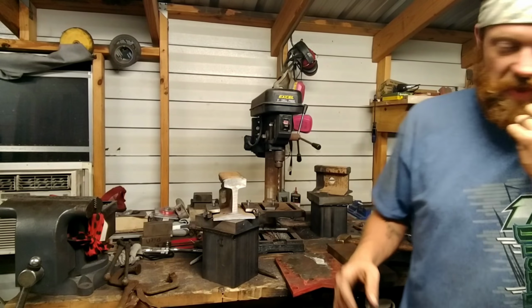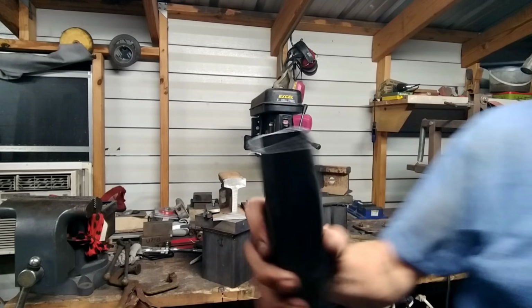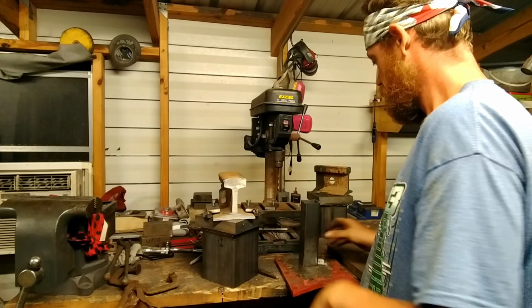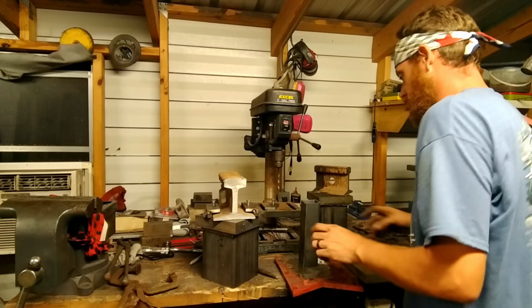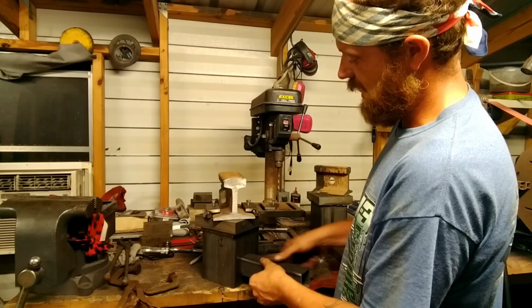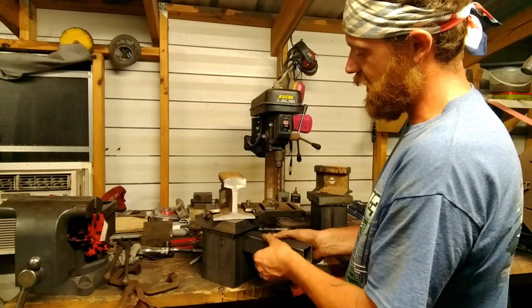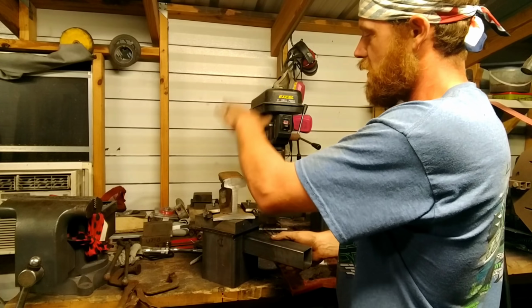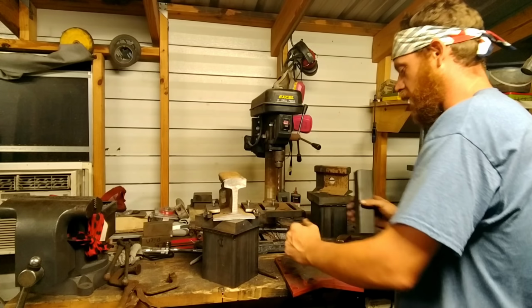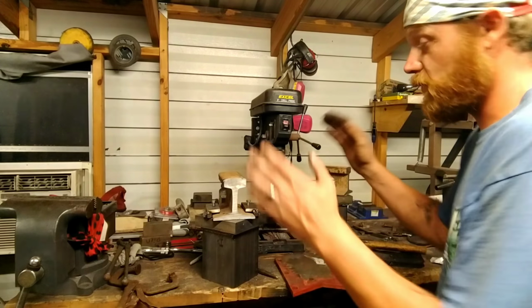And once we get it all exactly where we need, we're going to use some of this extra 4-inch wall tubing, cut a couple pieces, weld them to that, and they will marry up to the side of the ram, the die that's attached to the ram. That way it guides it nice and straight and keeps it true to come down and meet with the bottom die every time. So that'll happen in the next video once we start assembling the press, because we're almost there,